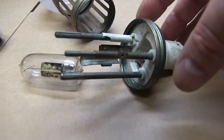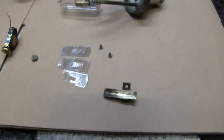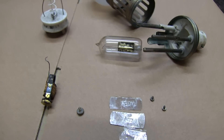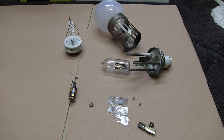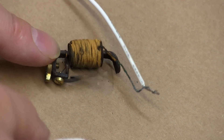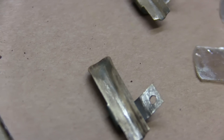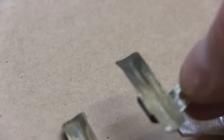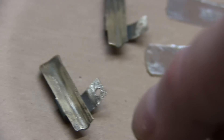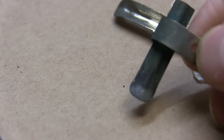There's the other contact there for the barretter, or the ballast. I've done this one a little bit to improve it. I've cleaned the contacts on this relay and it works. I've tried to clean these contacts up as best I can — they're not perfect but we should get electrical connection to some degree. They were absolutely black and not making contact.